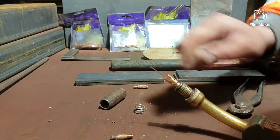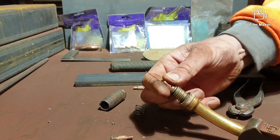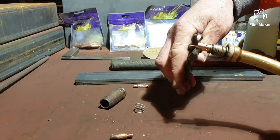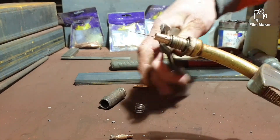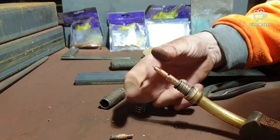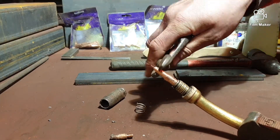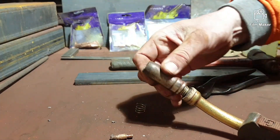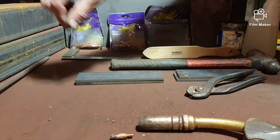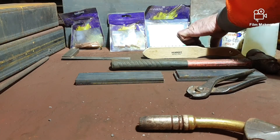I can feel this adapter is wearing a little bit but it's not too bad. Then we just give it a little nip with the cutters — the cutter becomes a multi-tool. Don't over tighten it. Same with the tip, just a little nip. Then the shroud goes back on and we're ready to weld.